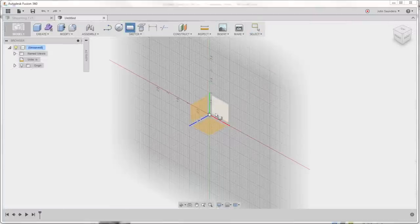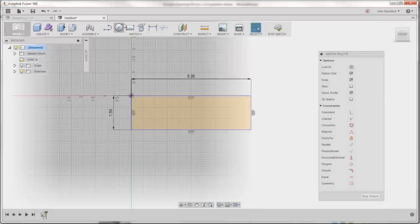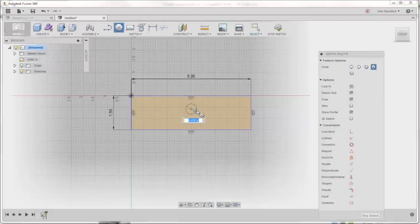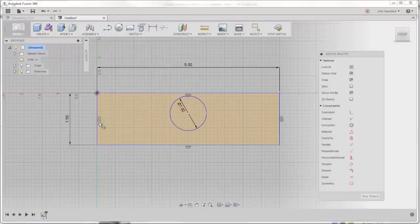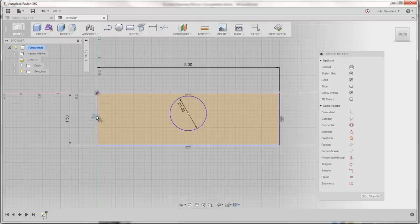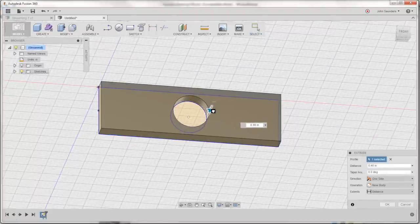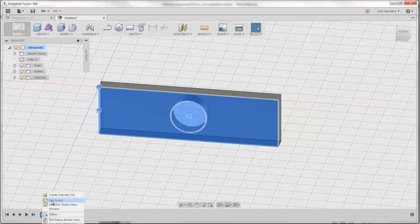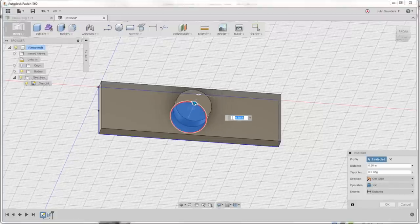Create a two-point rectangle on this plane. I'm just going to sketch and we're going to say it's 1.5 by 5 inches. We'll sketch a circle in the middle so we're not just facing it off. I can find the X center and make it a one inch circle. I'll do a sketch point to snap to halfway down that line, then select that point, hold down control, click that point and click horizontal-vertical. That snaps them perfectly centered. Right-click, press-pull, extrude that up. Then go back and extrude the center part up — press-pull, expand the sketch, and come up 0.6.